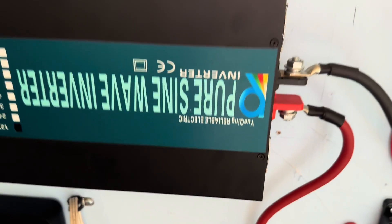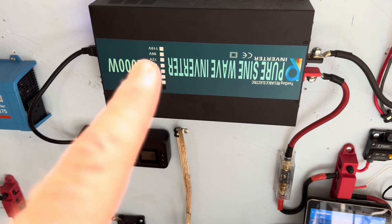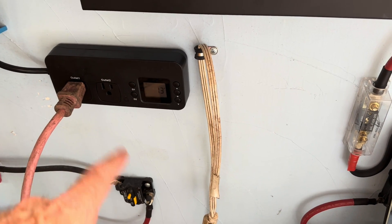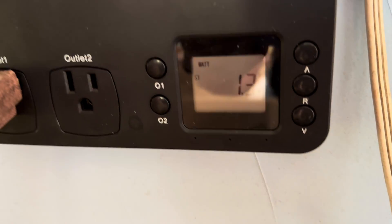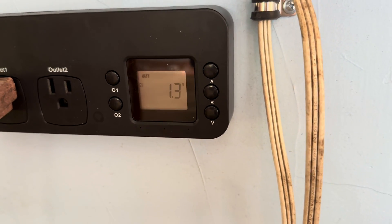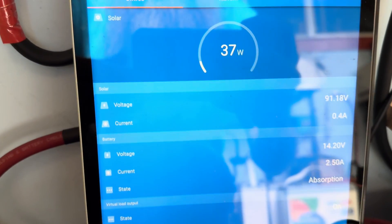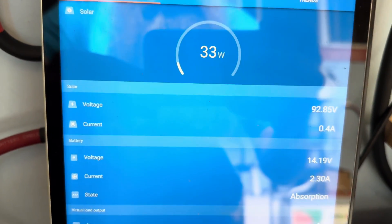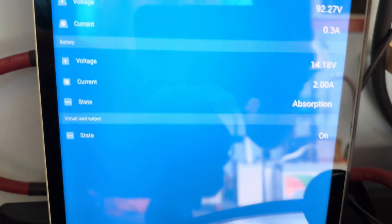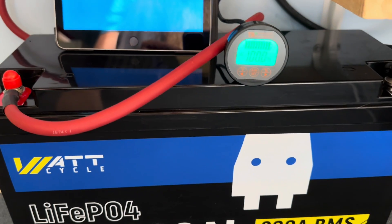This is the system we're going to draw off of right here. We've got that 2,000-watt pure sine wave inverter and a 20-cubic-foot refrigerator-freezer tied into it. Right at the moment it's not pulling anything because it hasn't cycled on yet, but when that cycles on it's going to start drawing this battery down. We're getting late in the day here and we'll be able to see what it does. Just with that plugged in, it opened up the wattage a little bit — still holding absorption at 14.2. And because there's a lack of sunshine right now, when that refrigerator does kick on, we should start seeing this go down.